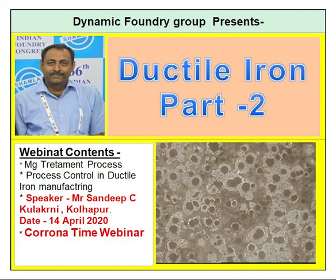Next is filling time, that is the tapping time. Tapping time you have to control. It again depends on foundry to foundry, on your foundry practice. For tapping and pouring time, you have to have a buzzer. When you start the tapping, you have to push the button, and within 7 minutes or 6 minutes, whatever stipulated time you have decided, you have to finish the pouring, and at the end of the pouring you have to take a sample for spectro and for the micro. You are not allowed to go beyond the stipulated time, because it will not guarantee you good quality ductile iron material. You may fail in the microstructure or nodularity. So it is very strictly to be followed.